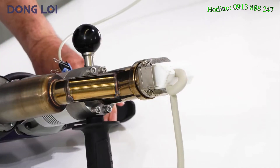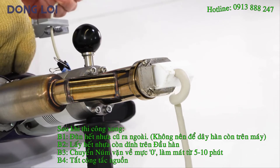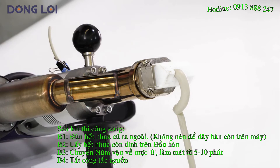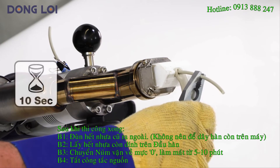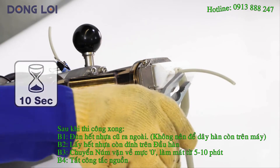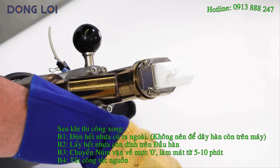Remove the welding shoe when the machine has reached operating temperature. Before changing the welding shoe or cooling down, cut a piece of welding rod. With a pair of pliers, push the welding rod approximately 1 centimeter into the hole in the welding shoe and hold for 10 seconds in the molten plastic. Pull the wire with the plastic plug out so that the welding shoe is clean.